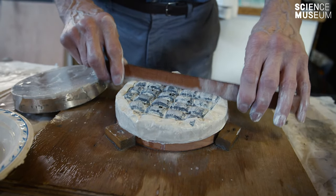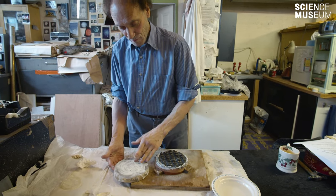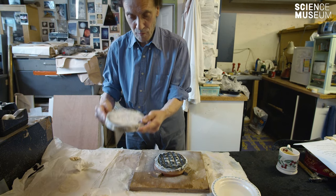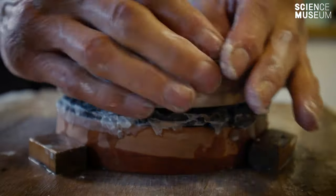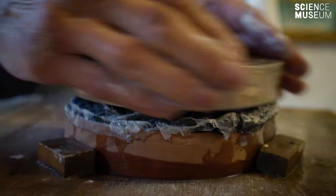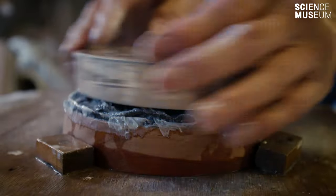Once that pitch is hard and set, you put your very, very fine polishing powder onto your mirror and you start polishing. The powder beds into the pitch — it doesn't roll around — it just sits there, and microscopically it acts like a plane and makes the surface go shiny again.